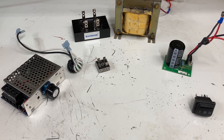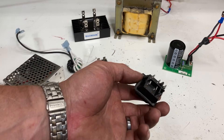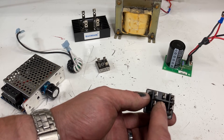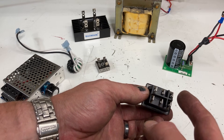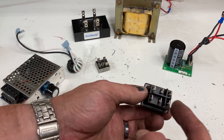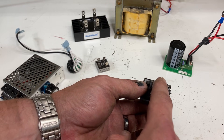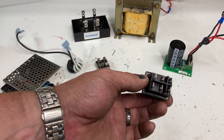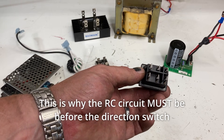One nice thing with a DC motor is if you switch the wires going into the motor, in most cases you can reverse the direction — super handy when working on something like a lathe. To do that you use a double pole double throw switch. You have two wires coming out of the middle going to your treadmill motor, then two inputs. If you put positive and negative on one side and negative and positive reversed on the other, when you switch it one direction it connects one way and the other direction connects the opposite, effectively reversing the direction of the DC motor.